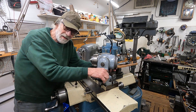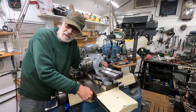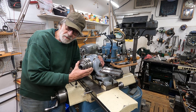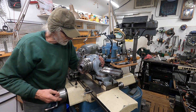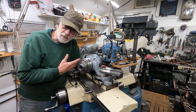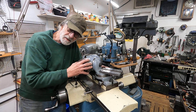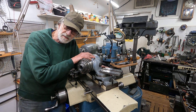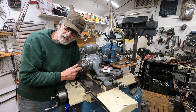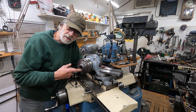Before you buy a machine, you better check out if it's got a work head on it. This is kind of like — it's not so much the horizontal, it's like I got it here — that nobody wants anymore. But this is hard to find: a good standard work head. This is a Cincinnati work head. It works, the bearings are good, nobody monkeyed with it, it hasn't been taken apart. You've got to understand that the assembly of these things — these have type zero Timken bearings, a really heavy duty head, and those are the most precision bearings. They grind the spindle tapers in the bearings, and if you take one apart and put it back together, it's likely not to run true.